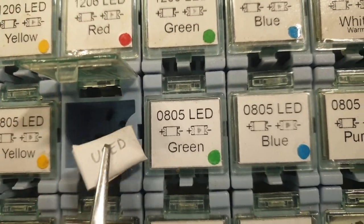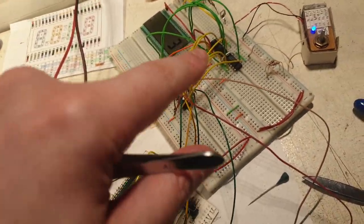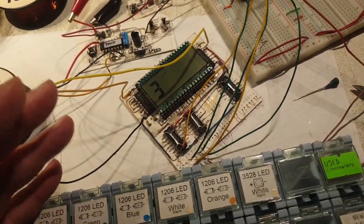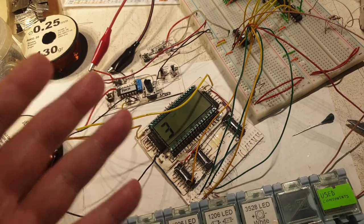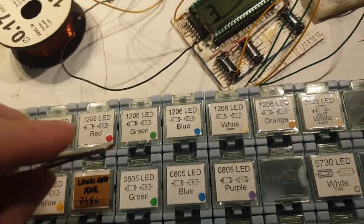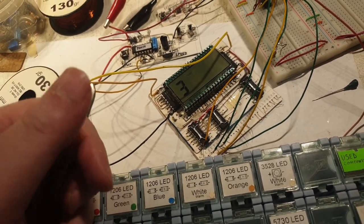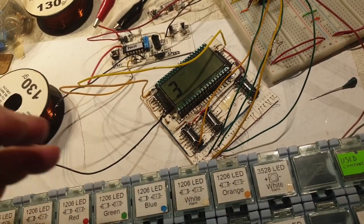I can show you the envelope with all the used 7486 gates — I didn't test these originally like I did with the 4030 XOR gates, which have four gates per chip. Those 7486s were completely untested. I trusted they'd work because they're XOR gates — wrong. I made the entire design with those little guys, spent a couple of days on the 3D design, then came back and built everything based on them. I was completely sure it would work.